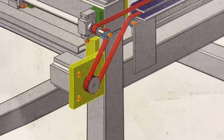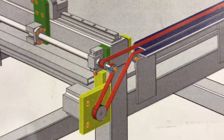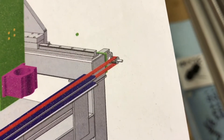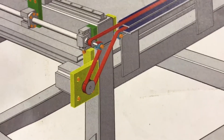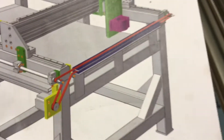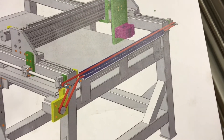There's also a grub screw which tightens down onto the keyway and locks it all in place. The belt will run around the big pulley, up around one of the little idlers, then around the little pulley, all the way along to the other side, all the way back again, around the other idler, and then back onto the big pulley. So the motor is then turning both ball screws simultaneously, and that should keep them in perfect time with each other.